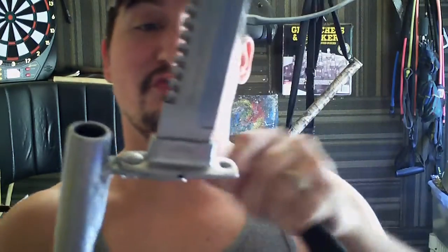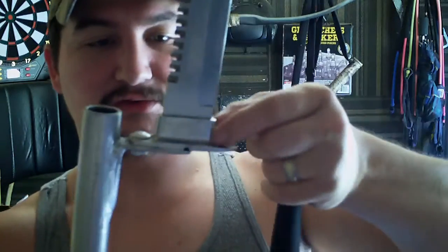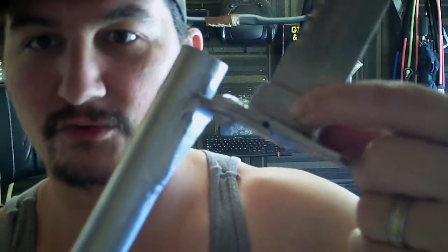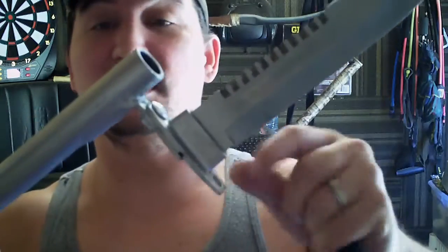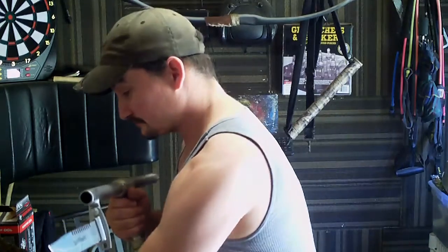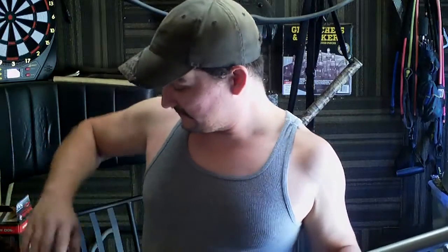As far as the knife blade goes, I drilled a hole all the way through — this is aluminum and this is stainless steel. I drilled through the center of it, screwed a bolt in just like I did the handle, and grinded both ends off. I ran JB weld all through the hole as well. I took this thing and stabbed it right into a treated 4x4 and it did not budge one bit. All of this is as solid as can be.